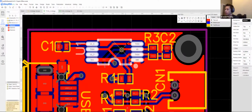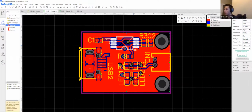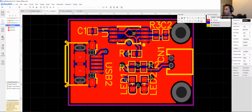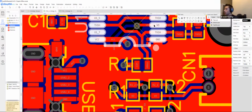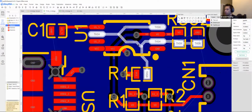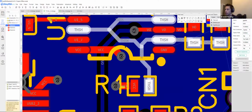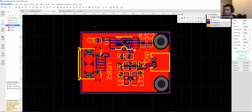And let's see, just solid. Oh, come on. All right, just drop this back down manually. So also the solid plane that we have here, we have to disable that if we change something. It's just because it's going to recalculate it every single time it enables it. So if you do want to change any of these traces, you're going to need to turn that off, change your trace, and then turn it back on to assure that it still works.